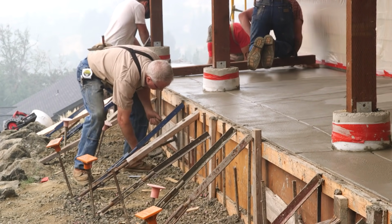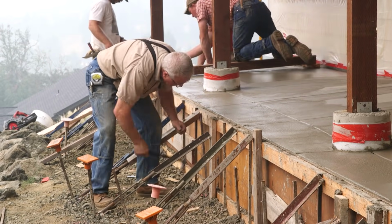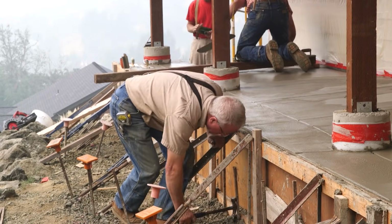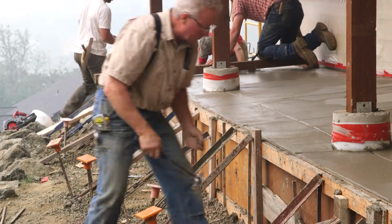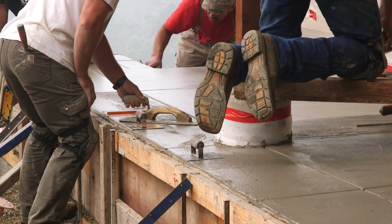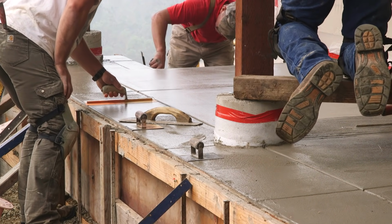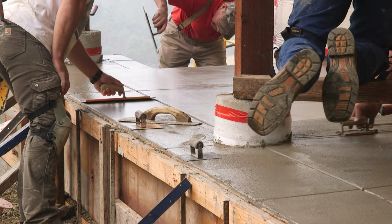If you take the forms off too soon, the slab is going to slump down under its own weight. If you take them off too late, you're not going to have enough time to finish that vertical face before it gets too darn hard. Let me tell you, now is the moment that a big, capable crew of strong, experienced, conscientious finishers is such a giant relief.